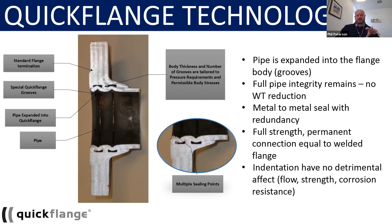But how does it work? Well, ultimately, we're taking the two pieces of material, whether it be the flange and the pipe, and we're plastically deforming it — working on the elasticity of the two materials. What you can see in the deformation there of the pipe, where we've actually pushed it into the groove, the pipe is ultimately trying to straighten back out. It's the molecules in the material trying to straighten back out, and we have ever so slightly dilated that flange, where it's clamping back down on the pipe. So ultimately, the weakest component of this connection is the pipe itself.